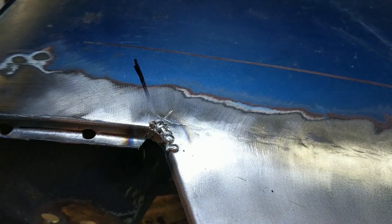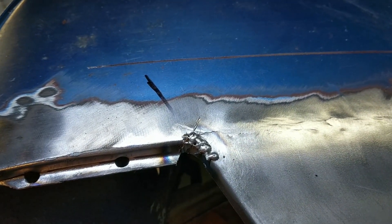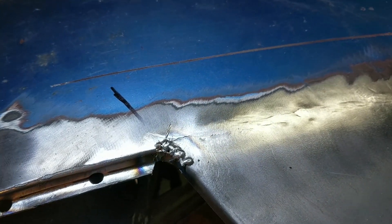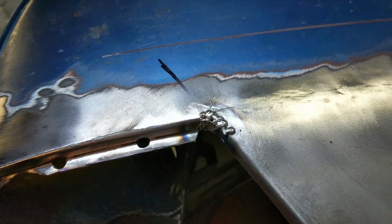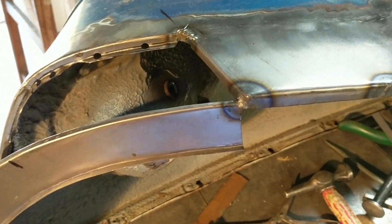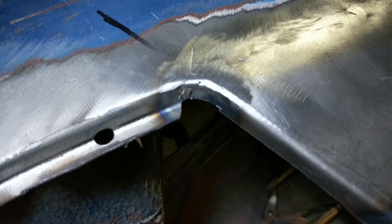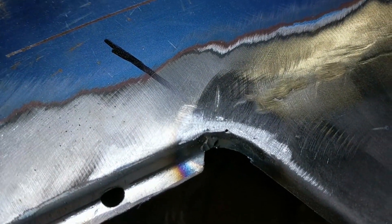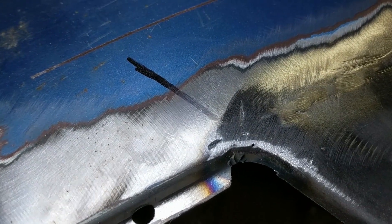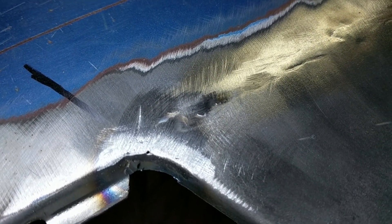The hole's gone — it's a little messy. I just wire-brushed that real quick to get all the residue off, but I'm going to grind that down. There are probably a few pinholes in there. I can fill up the pinholes with the TIG welder — this was a quick and easy way to get that hole fixed. The curve looks okay. I need to look at some pictures once again to decide how this corner is supposed to look, because I don't think it's supposed to have that square cut right there. You can see a pinhole right there — there's at least one big one and probably two small ones. I'm just going to go over this whole thing with the TIG welder and seal those up so there's no corrosion or contamination on the backside.